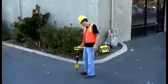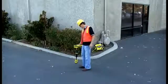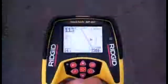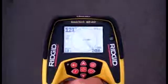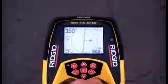Here's a technique that can help you evaluate a signal for distortion. We'll demonstrate this technique using the same location and connection point we used in Line Trace Basics. We'll acquire the signal, center the tracing line, and align the receiver with the signal just as we did before.